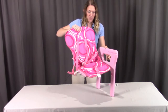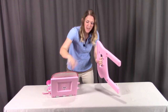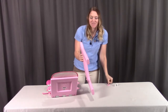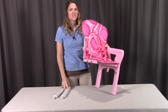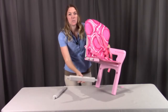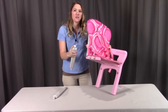When it's all put in place, it'll go in here and the back pin will go into this insert. Lay this down first, align these two holes with these two holes, and put the caps back into place. Use the assembly tool provided to make sure the caps are nice and tight. Once this is tightened in place, the next thing we're going to do is put on the chair rails. When looking at the chair rails, you are going to see one side that has the numbering. Make sure you put these chair rails into place with those numbers out of sight so you're not having to see them. These also have caps on which will need to be removed prior to putting them in place.